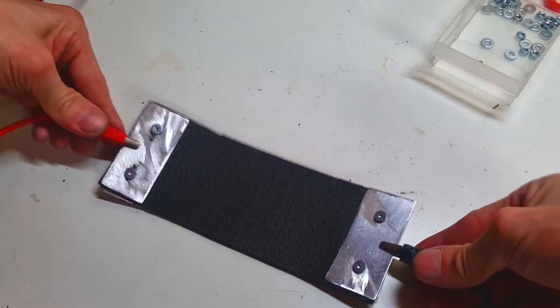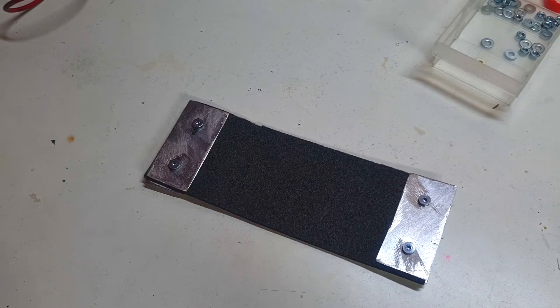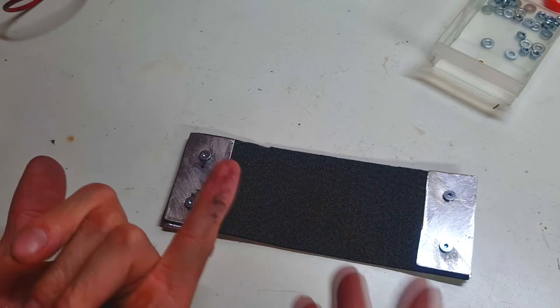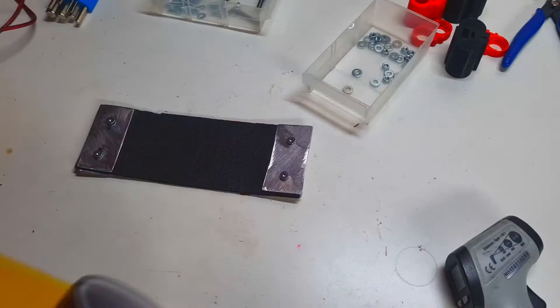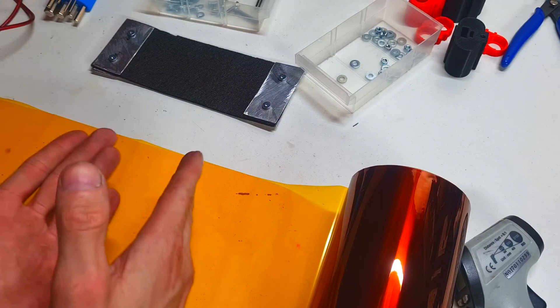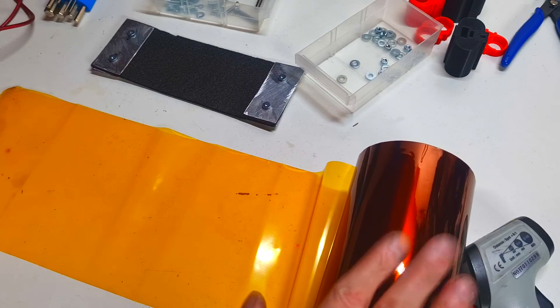For the finish I will make this heater a little bit safer. For the heating element I use this graphite carbon felt, and this graphite carbon felt can release some carbon dust, which is not really good for you. For this reason I will cover this heater in some Kapton tape. The Kapton tape can withstand temperatures of around 260 to 300 degrees C, so if your heater's maximum temperature is around 200 degrees C you can use Kapton tape with no problem.